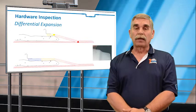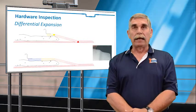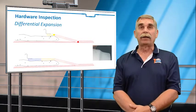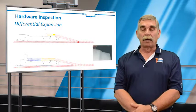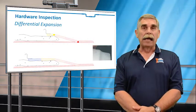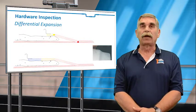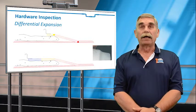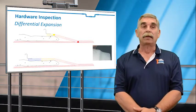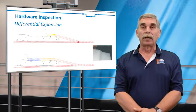For this reason, the industry had a number of failures at cone welds, and responded by developing wedding cake expanders. These are tools capable of taking straight pipe and expanding a bell into them, eliminating the two welds at the peak stress points. To my knowledge, we have never had a failure of an expanded pipe segment like this, and as a result, the industry has all but eliminated welded cones.